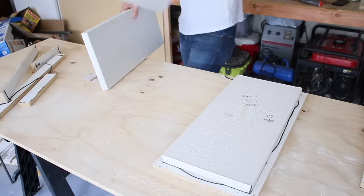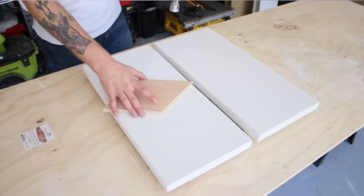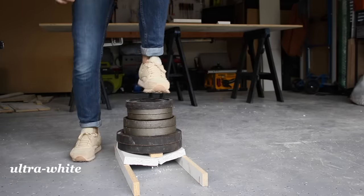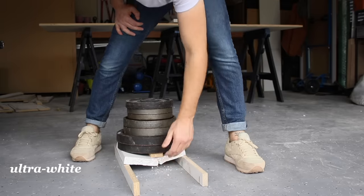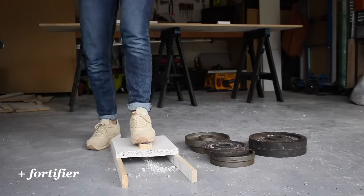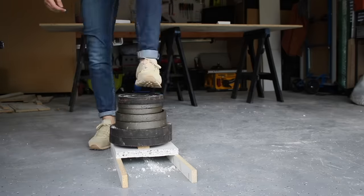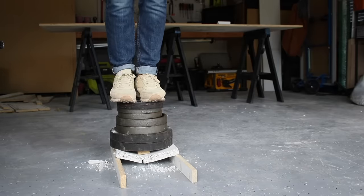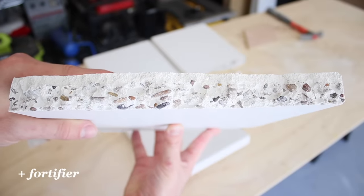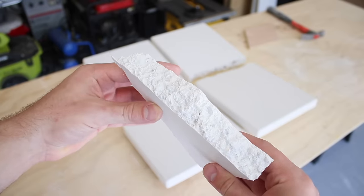You can see the contrast in the aggregate due to the moisture still in the concrete. After letting them sit one more full day, I knocked the pieces in half for another strength test. Unfortunately, the ultra-white concrete with aquarium rocks did not perform as well — it could support the weight plates fine, but not me on top of it. The good news is that the concrete made with the liquid fortifier was the strongest of all: not only could I stand on it with the weights, but it didn't break until I basically jumped on it. Even though the ultra-white concrete wasn't as strong, it still performed decently and looks amazing.